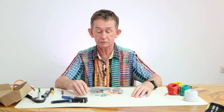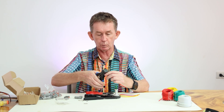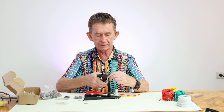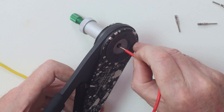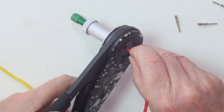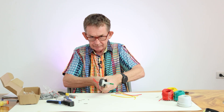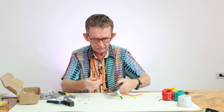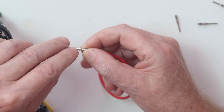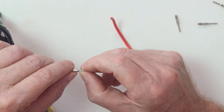I'm going to show you how to put the wedge in, how to take the wedge out, and remove them on both receptacle and plug. We strip the wire back approximately seven millimeters — that's what I normally do. You can check yourself if you want. Put the pin inside first, push it in the whole way, then tighten it in as tight as you can.